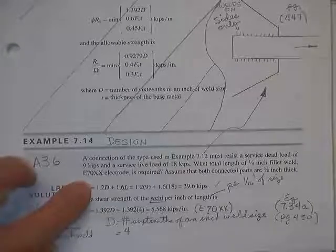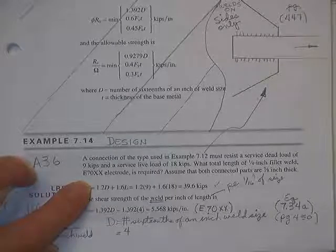Okay, that'll work. How much tensile stress does an E70 rod have? Yeah, it's an E70XX, actually. Now I see why you were delaying the inevitable. 50, very good. Add a little to that, though. You'll go a little higher than that. Yeah, all right, 70 ksi. That's right. That's why they gave it that name.